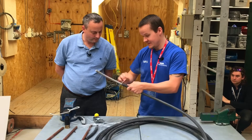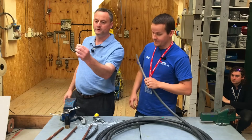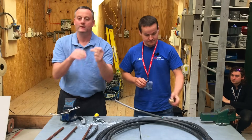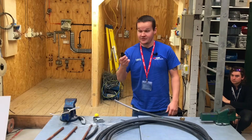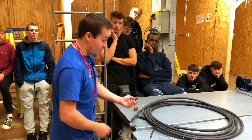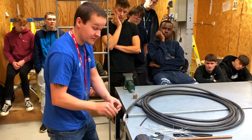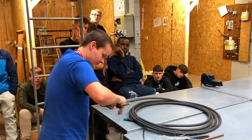The cut is done. Chris demonstrates the hook effect as an exaggeration — that's what happens when you haven't sawn in enough with a hacksaw and forced it to give way, which makes the next part of the process more difficult. Next, grab your shroud — or sock, as some people call it. It's normally coned on the end so you can squeeze it down and wherever the cone meets the cable, cut it there, and you know it'll fit perfectly.